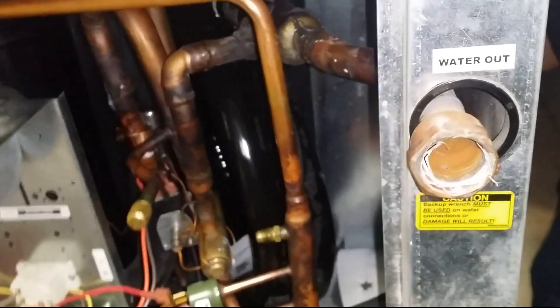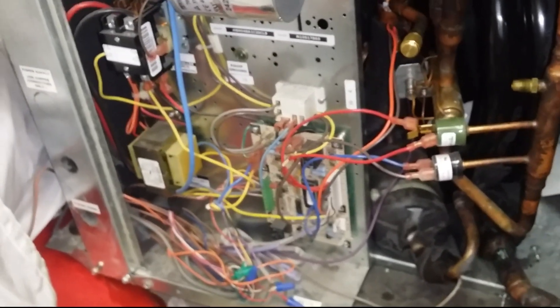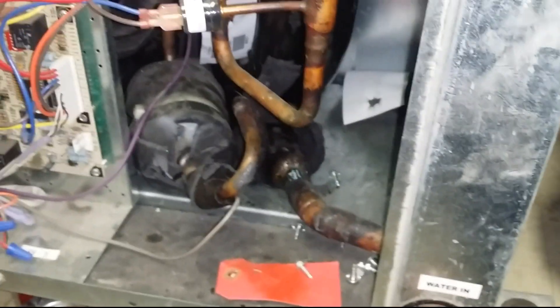If you have 80 going in and 82 or 85 coming out, you don't have the proper temperature differential — most likely your tube-in-tube condenser coil is dirty. And high temperature differential means you don't have enough water — you're starving. Remember: 3 GPMs per ton. Most manufacturers ask for 3 GPMs per ton, though not all manufacturers are the same. From calling tech support over the years, I was told 3 GPMs per ton.